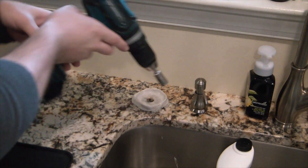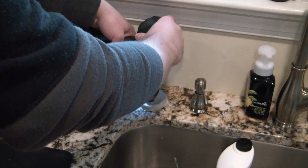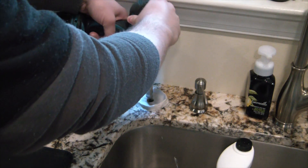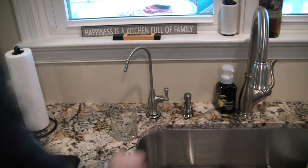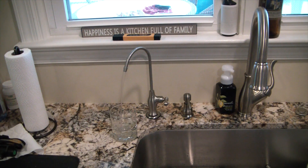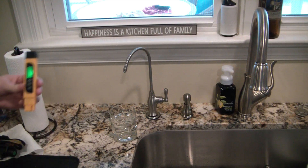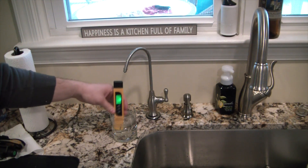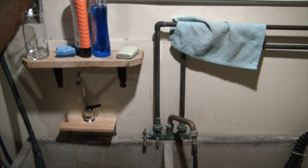I'm a little late to record but just broke through — going to take the final bit of cut here. What a beautiful hole! So I just wrapped up the bottom-end connections, let it flush for a couple minutes to get any contaminants out of the line. We'll see what kind of TDS we're getting up here. I did another flush of the RO system, so I'm hoping it's a little more pure. Sixteen — 16 parts per million, not too bad.